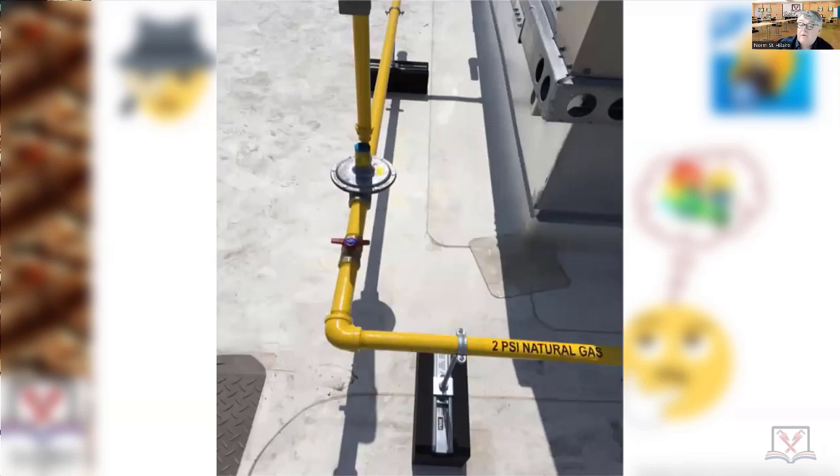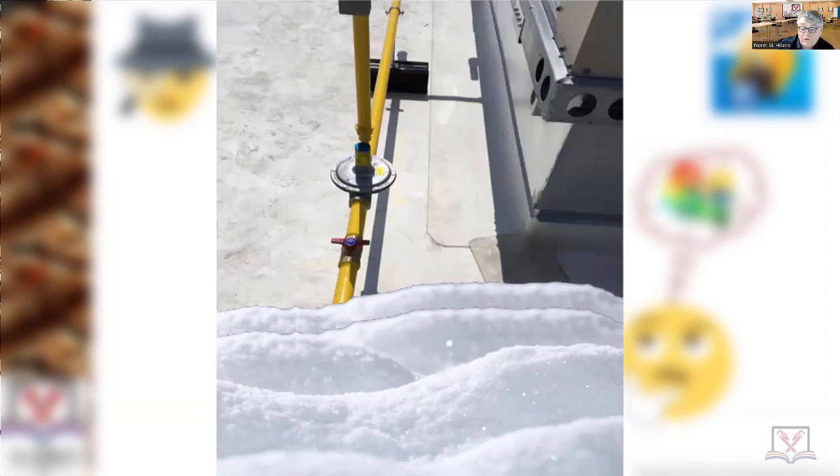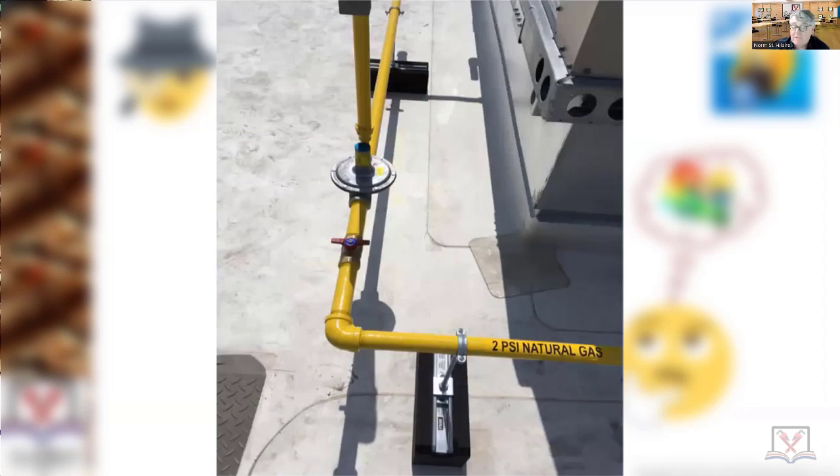Why is this vent above that high? Because the plumber in this case is paying attention. When it's January you need to be thinking about snow — you have to have that situational awareness. If snow piled over that regulator vent, the regulator is not going to work right. A lot of people do not know that and don't realize their units aren't operating properly because they're not getting the gas they're supposed to — the regulator is compromised. Snow covers the vent opening, the sun comes out, melts some ice, water drops into the top of the diaphragm, and now all bets are off. You think you need a crane to rip the unit off the roof when really it's someone with a license who doesn't understand how things work.